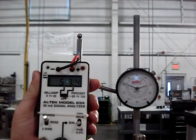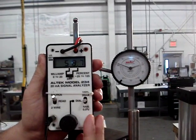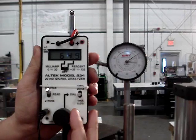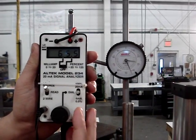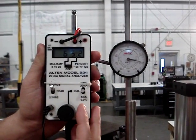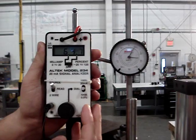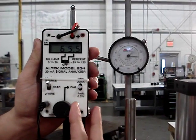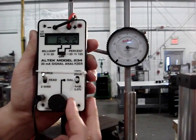And to show you the frequency response and the dead time — you can see I can make very small set point changes, and regardless of the size of the set point change, the response is virtually instantaneous. 70 millisecond dead time. As fast as I can change my input signal from my control system, I have valve stem motion.